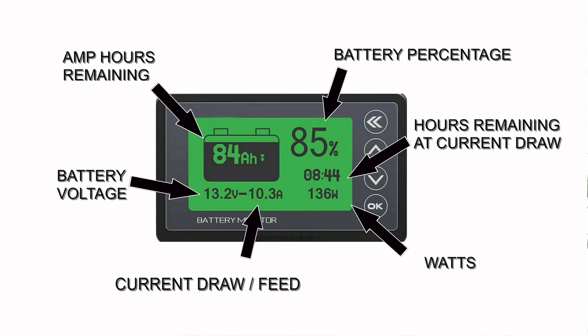For example, if we are using our lights, it'll say at the current conditions you will have X amount of hours before your battery is depleted. It's really important to note when you're using a shunt that nothing goes to your negative terminal except the shunt, because the way the shunt measures how much power is going in and out of the battery, it makes sure everything has to go through it. If the shunt is bypassed and something's connected directly to the negative terminal, it won't be measuring any of that in or out voltage.